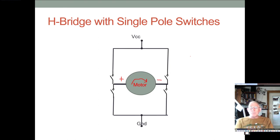It's getting enough continuous power that it's working continuously. It's sort of like you could replace this with an LED, and with an LED, you don't want to see the LED blink as you vary the intensity. Well, it's the same thing with the motor, but the fusion rate for the motor is a lot slower than it is for an LED. For an LED, you probably have to get it up above 100, 150, 200 hertz or something like that to fuse the LED. But with the motor, you can do it at probably lower frequencies. However, our pulse frequency with a typical H bridge for a typical DC motor is very often maybe 5, 6, 7, 8, 9, 10 kilohertz, something like that. So it is pretty fast usually.